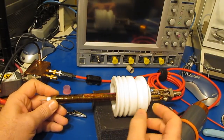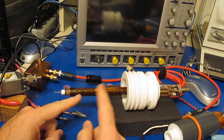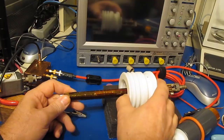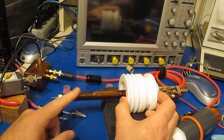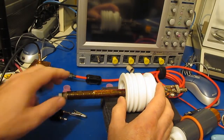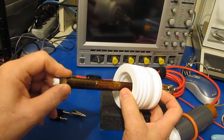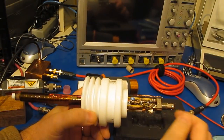I've seen quite a few videos where people had made high voltage probes - what they'll typically do is take a bunch of resistors, put them in series, then put a small capacitor across each one. If you've watched videos where I've made high voltage probes, I've always just used a piece of magnet wire like this to make that capacitor. There are a couple of reasons I do that: one is I can tune this thing to get a fairly flat response out of the probes, and the other reason is the breakdown voltage for this is pretty high - this phenolic tube is up there pretty good, and layered with that Kapton tape.